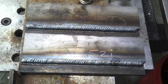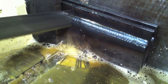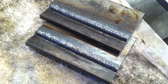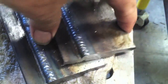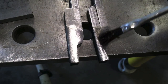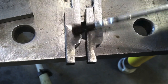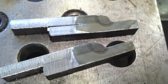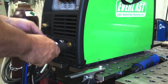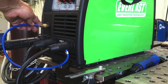There you see the two welds — not a lot of difference. The ThermalArc Fabricator 252i is on the bottom and the Everlast MTS 250S is on the top. Just for kicks, I'm going to slice a couple of sections out with the bandsaw, give them a quick sanding and polish just to see penetration and bead profile. I'm using a passivating solution — basically a nitric acid solution — designed to dissolve free iron off stainless steel, but it sure does reveal a weld nugget. Both look very similar: adequate penetration into the root of the joint, a little crowned and convex from being in vertical position, but that's pretty normal.